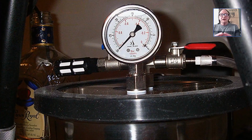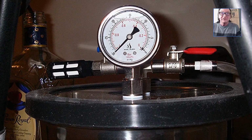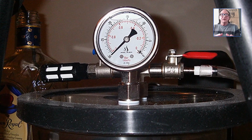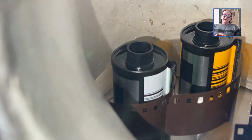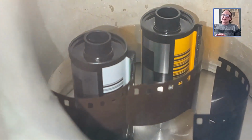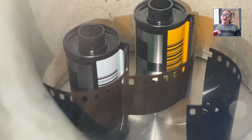A roughing vacuum is basically what Robert has, right? That chamber comes down equal to, say, 50 to 60 miles off the surface of the Earth. All right, you're still actually in the atmosphere. That's as far as it can pull it down. When you get these turbine vacuums that pull it down past that, even Bill said to me, when you get past 10 to the minus 4 torr, things start to happen that you had no idea would happen.